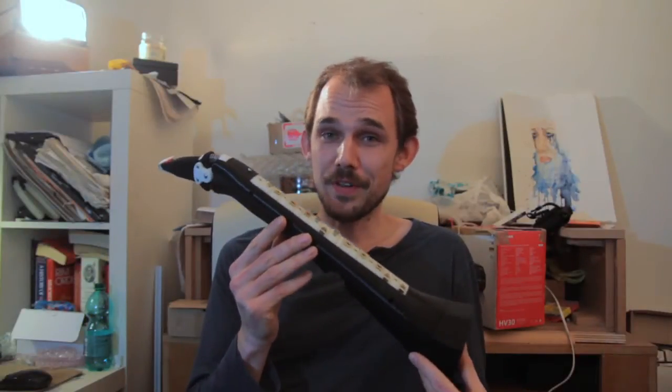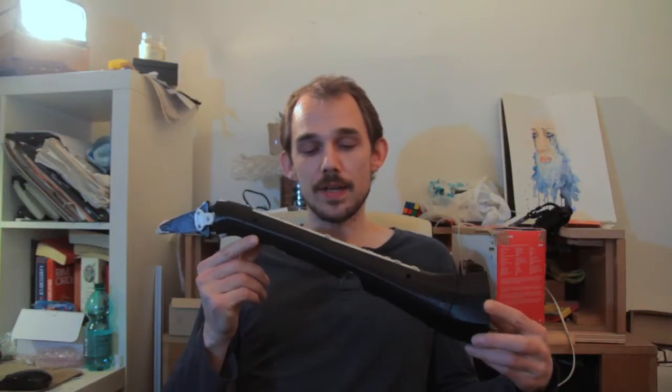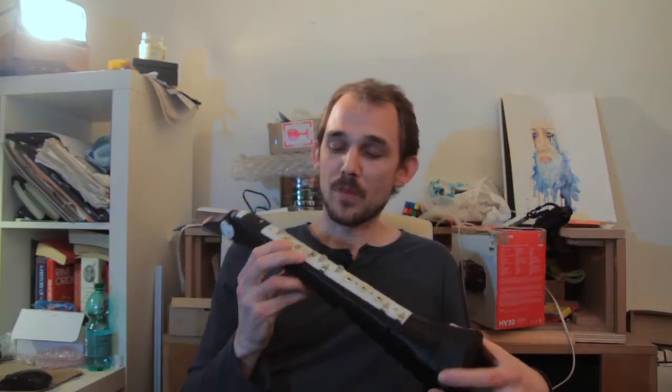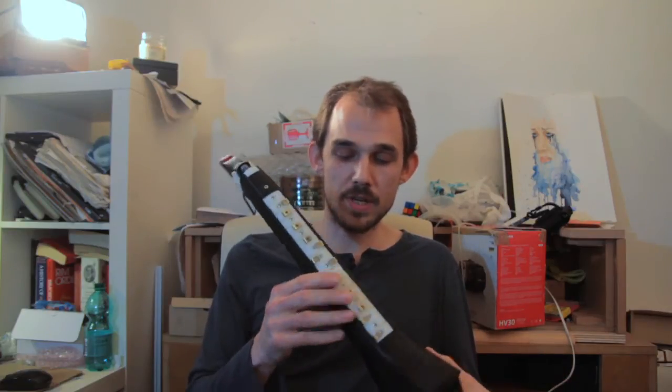Hello and welcome to the very first video presentation of the Open Horn MIDI System, or OHMS for short. OHMS is an electronic wind instrument with a bunch of cool features, like a breath pressure sensor made from a force-sensitive resistor and water balloon, an awesome bend sensor for pitch bend control with your mouth, resistive touch switches used as keys, and an LCD at the back used to navigate the menu system.